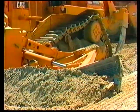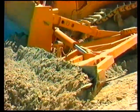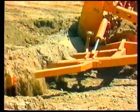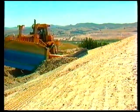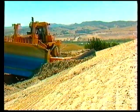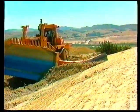As the slope board trims and fills the dozer blade with excess material, turn the dozer away from the slope and lose the material beyond the bench. Back up to where you left off and begin again. Continue this process the entire length of the slope. To continue bringing the slope down, start using the right side corner of the dozer blade to push the excess material that is creating the bench down at the proper slope ratio.